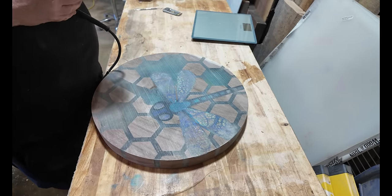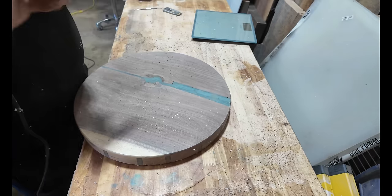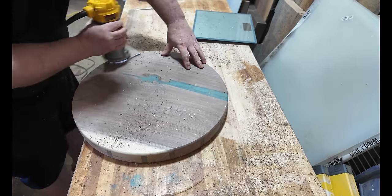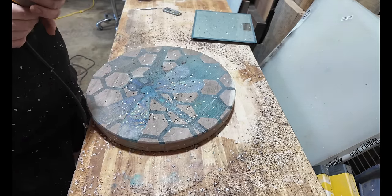But when you do the sanding with a 60 grit through the drum sander, it's a lot more than a couple of passes. You have to sit and work on it for a little bit to get all the scratches that the drum sander left in the wood. Trust me, it's still way easier than starting from nothing, but flattening would make it a whole lot smoother to start with.